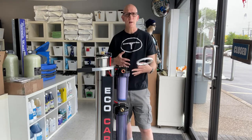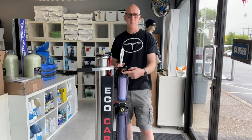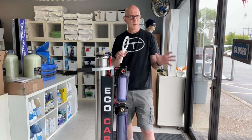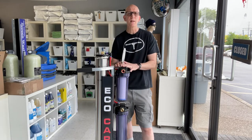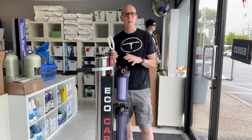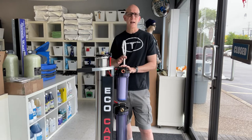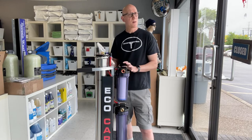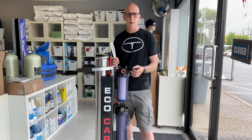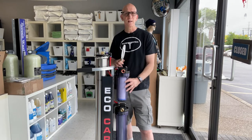The biggest question is: when do I change these filters? The first filter the water contacts is always the pre-filter. It'll be some form of either a separate sediment filter and carbon filter, or in many cases a combined sediment and carbon filter. Most are rated to need changing every six to eight weeks in our industry, depending on usage. If you're using this daily, definitely change it within two months or sooner. You may also find one day you get a significant pressure drop — it could be that the last job had a lot of gunk clogging up this carbon filter, which is protecting the RO.